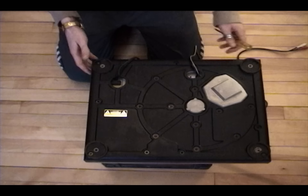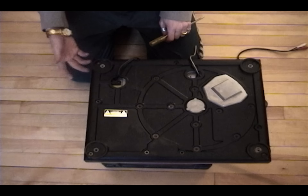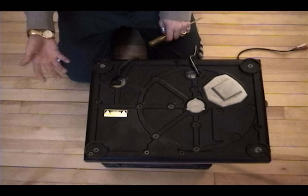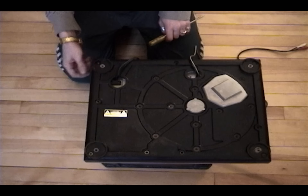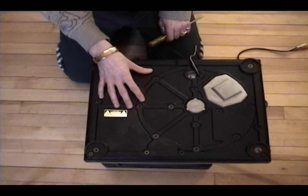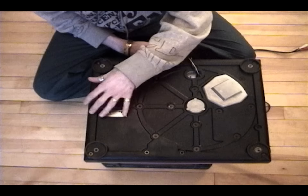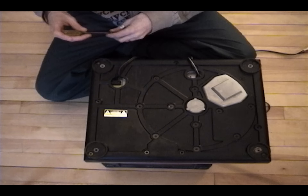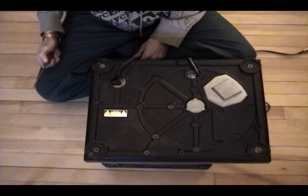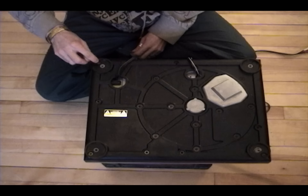They had the SL-1200 Mark 1, which was almost the same size but had two rotary knobs to change pitch instead of a slide pitch fader. Matsushita, the company that builds the 1200, decided to attack the disco market by making a more ergonomic turntable for DJs. They came up with this rubber base. Underneath is a piece of carbon fiber — or possibly carbon — that fills all void space under the turntable, making it a completely solid mass, which is why it resists feedback so well.